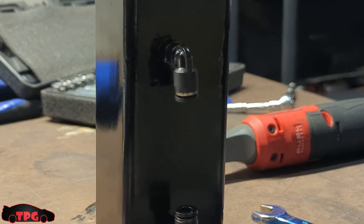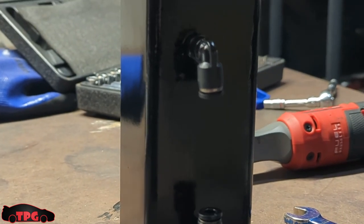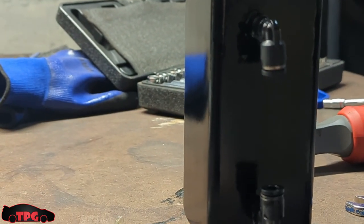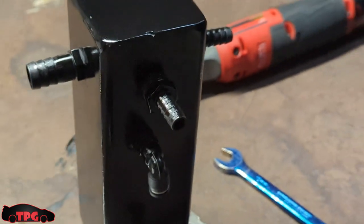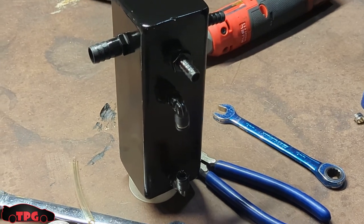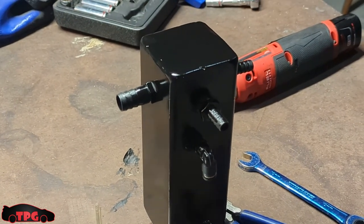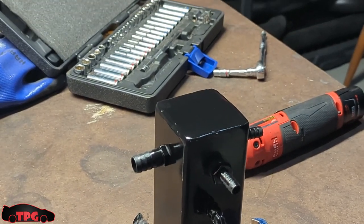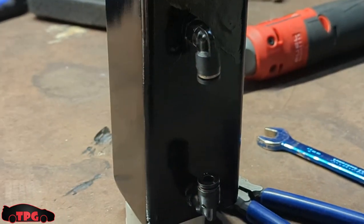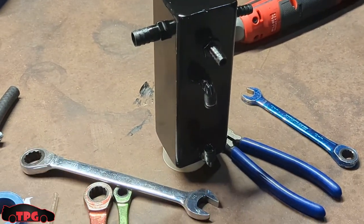I'm going to end this one off — it's been a fun one. We got to mess around, do a little fabbing, work on our welding skills, our grinding skills, and all that fun stuff. If you guys have stuck around to the end, I definitely appreciate it — big thumbs up to you guys, thanks for watching all the way through and thanks for supporting the channel. We're going to throw this in the car here in the next day or two once the paint dries and test it out. It's going to keep all the extra oil from blowing into the intake manifold through the valve cover vent line and the PCV line. I don't know how much it will hold or how long it's going to take to fill it, but once we get about halfway full, all you've got to do is pull that little ball valve and drain her out. Make sure you guys subscribe and stay tuned for the next episode when we install this thing and do some other tuning work.